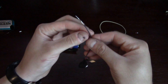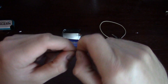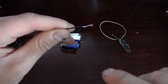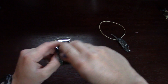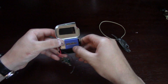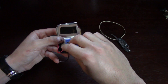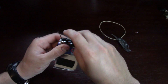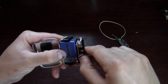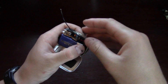On the other end, go ahead and fold this piece in half and twist, just like so. At the end of the wire there's going to be almost like a knob where you bent it — that's going to come in handy in a second. The next step is to connect the connector to the 9-volt and put it in the tin. The 9-volt is going to sit in the tin just like this, with the USB going in with the pokey side towards the battery. Your red wire is going to be twisted and fit right in this little area, and your black wire is also going to go down there.